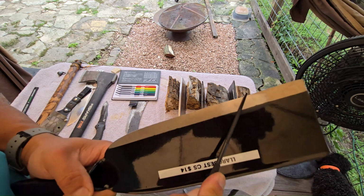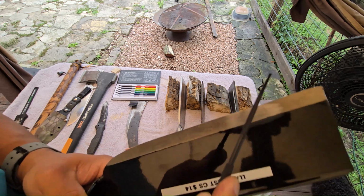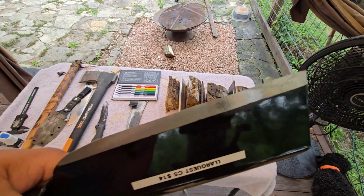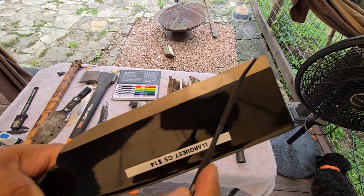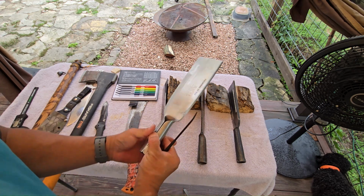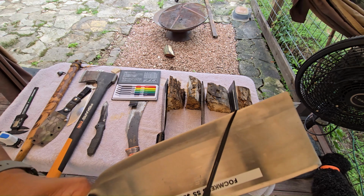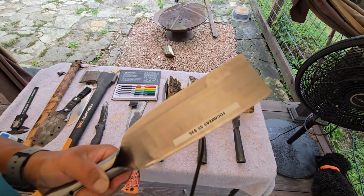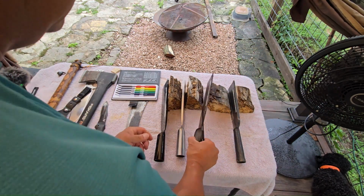Okay, let's see here. It's already biting. I can feel it resisting. Can you hear it? Okay, you see it right there? It's scratching it. So that's definitely softer than 65, which I would hope it was. And then the stainless. Yeah, the stainless, it digs right in, really easy. It's like gouging it. You see it there. So okay, stainless is not 65.